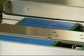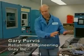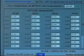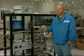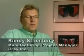This is the Cray Qualification Lab, where we actually test our hardware components. As you can see, we have lots of chambers for testing — thermal chambers, humidity chambers — as well as examples of piece part components and large assemblies. On each multi-chip module, there are eight die, each with a thermocouple, and we monitor the temperature on each die through a data acquisition system. We also do up to 6,000 power cycles, which is our reliability goal and equates to about 3,000 power on-off cycles for the field customer.